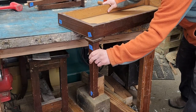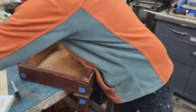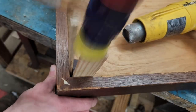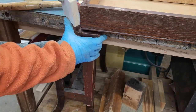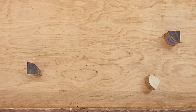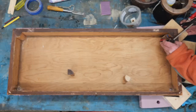Two out of the four legs — I guess we can call that half — were loose but would not come off. So I used the heat gun to help loosen the glue joints. With the bench dismantled, I can start putting it back together. The first step is to re-glue these corner blocks. I'll make some clamping cauls to help me glue up the odd shape. One of the four corner blocks would not come off, and I didn't want to risk breaking it.